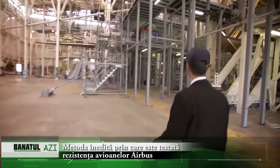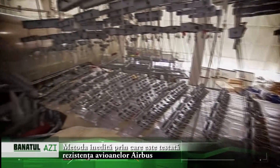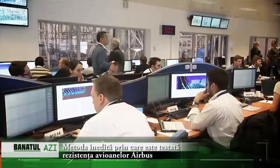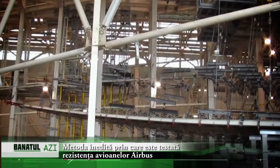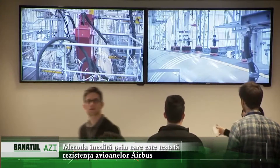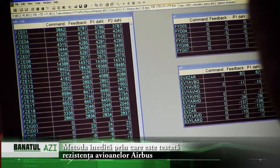What is planned in this test campaign is to load the specimen mechanically and also to pressurize it. We will go to the extremes to check the structural behavior of the bird. When we load it, we will pull upward the wing, pull downward, pull the fuselage — in all the critical situations. We have installed 12,000 sensors on the specimen.